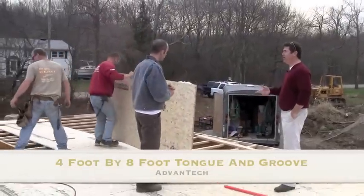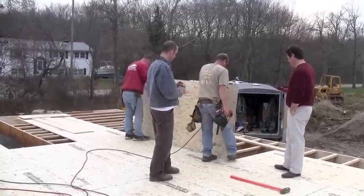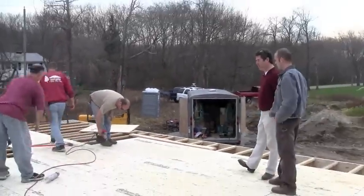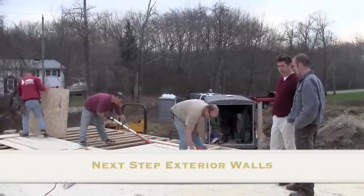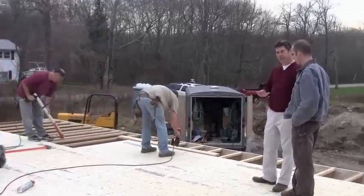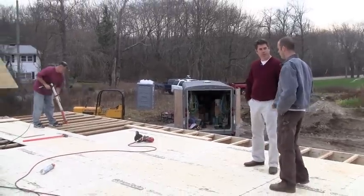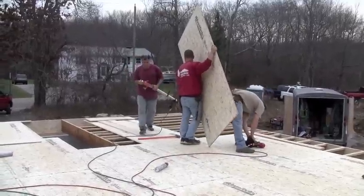This is a four-foot by eight-foot sheet, tongue and groove. They're going to lay this down now on top of the glue. This goes like within a couple hours and you have the whole floor done. The next step — we're going to do walls, start laying out the walls and the plates on the subfloor. With the AdvanTech, it's a material that's got exterior glues in it, so during construction when wind and rain hits it the board will not fall apart on you — the plies will stay together. It's a good product for exterior subflooring during the construction process.